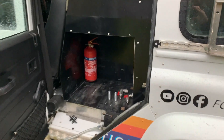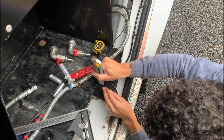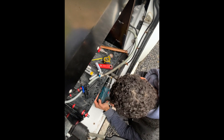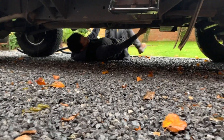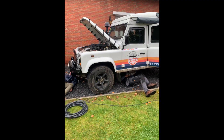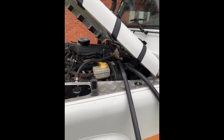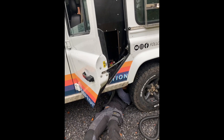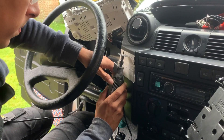This will be a hot shower system for us — it is going to change everything. The first step is to check where we're going to be cutting and having the cables come from the engine. This is the best place for the water tank, seeing that it is at seat level of the back seat. Here we've drilled a few holes; the cables come through here, tightened below the car on the chassis, brought back to the front, and intersected where the coolants are. One cable continues its normal course through the engine and the other goes under the chassis into the water tank. Meanwhile, we are cabling up an LCD screen which will show the temperature of the water tank directly from the passenger and driver's seat.